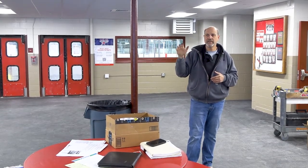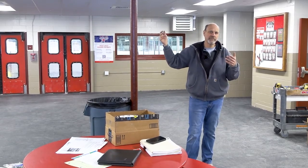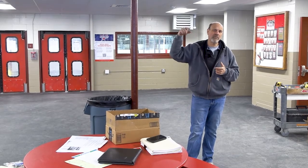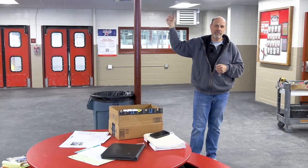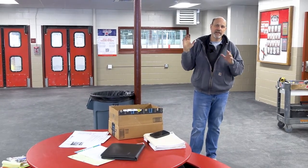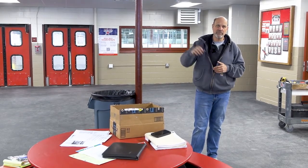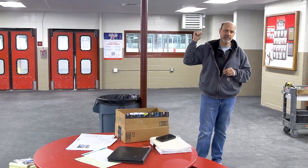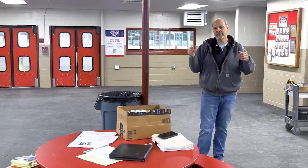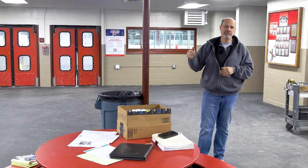There's individual locker room heating control and a ventilation control for all locker rooms done through an energy recovery ventilator on the roof. That unit has a hot water coil pulling heated boiler water to preheat incoming air. It provides code-required ventilation for the locker rooms, shower rooms, and bathrooms. There's one other smaller energy recovery unit in the rink area servicing only the new ticket booth, which also has electric baseboard heat since hot water can't be run out in the rink area.